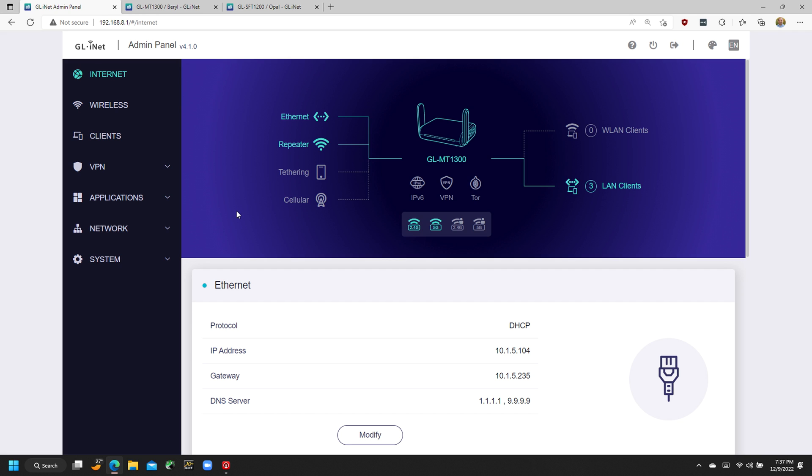What makes this one unusual is that you can actually have three of these four connected at any given time. You can have your ethernet plugged in, you can have it logged into another Wi-Fi network such as the venue's Wi-Fi, and you've also got the option for tethering to a smartphone, hotspot, or cellular modem. So if you get into a venue that doesn't have an easily accessible ethernet connection, you can jump on their Wi-Fi, or if you want to add another layer of redundancy you can connect to their Wi-Fi network and use that to provide internet for all of your network.